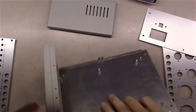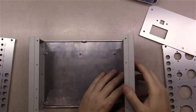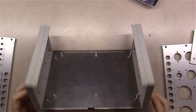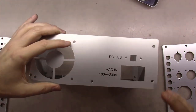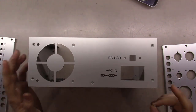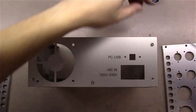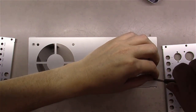The left side is on. One thing to note: the part with the overlapping lip goes upward, and the part without it goes on the bottom. We've got both sides on — took about 30 seconds. The side with the little tab goes on the back, and the back panel has a hole perfectly for it. I find it easier to put the screw on the end of a magnetic screwdriver rather than insert it by hand.